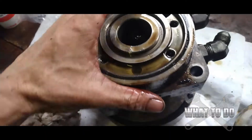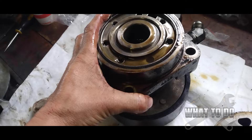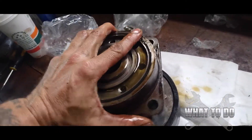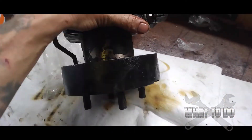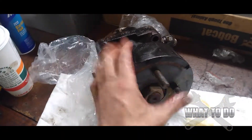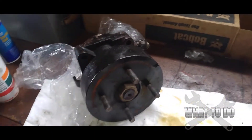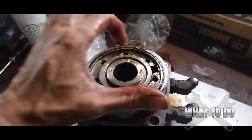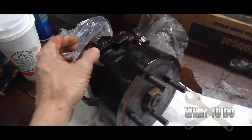Beneath here is your bearing, and I can already tell by what this is doing — it's going to be the bearings that fell out inside the motor, and they're grabbing and preventing this from turning. I don't have my puller here so I'm going to do a separate video on pulling off this hub. You have to be really careful pulling these off because there have been cases where these things go flying across the shop and you could really hurt yourself. If this is what you're experiencing, you're going to have to replace that bearing and pull this hub off to get to it.